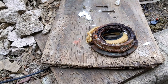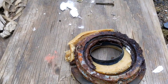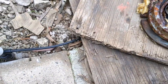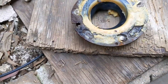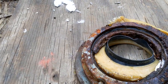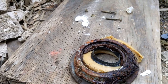I wanted to show you what I found on the bottom of the toilet — imagine this kind of being upside down from where it should be. You can see the flange from the wax ring, and you can see the fact that the wax ring didn't go in straight — that's not a good thing, but hopefully I'll correct all of that. Flipping it over — so there you can see the original flange at the top, and I guess this other piece was connected to the pipe. Actually, it looks like there may have been a previous repair. Either way, we've got to deal with this so we can have the toilet back.